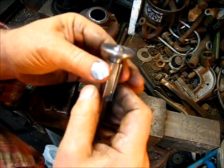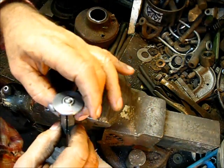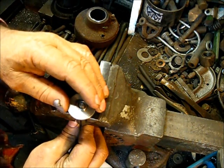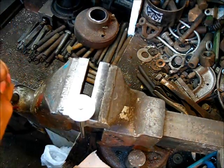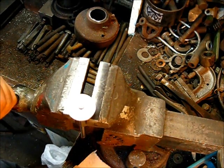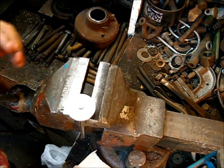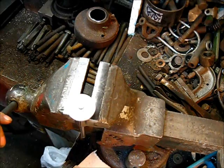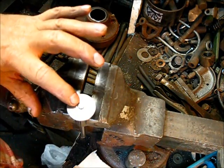This right here will just be a light sliding fit up to the valve head — that was a flat surface. Put this in the vise with both of those halves as a good tight sliding fit and grip up on that vise, even to the point of securing a pipe on the vise handle. We're going to tighten that up right before it breaks.